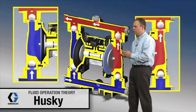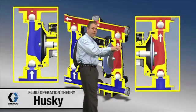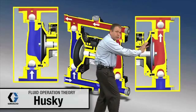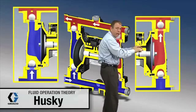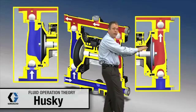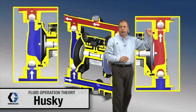Right now it's just stalled under pressure. In the diaphragm area over here, this diaphragm is pushing in this direction. When it does that, it's creating some pressure, causing this ball up here to lift off of its seat. It's also causing this ball down here to check or to seat. So any fluid that's caught in this chamber right here is going to be pushed up and out of the pump.